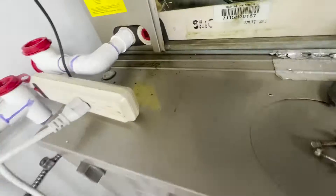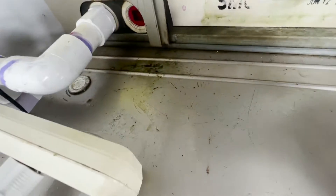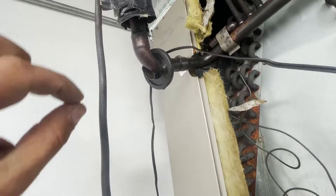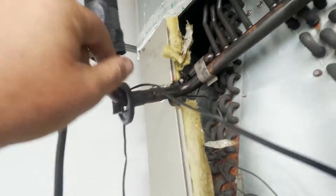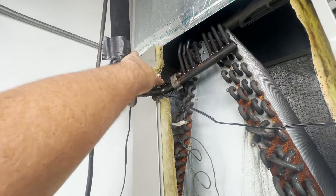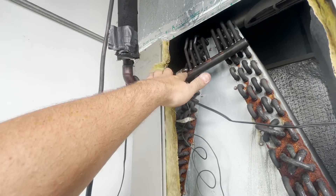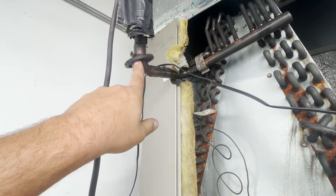F3, furnace 4. We got a call because this oil is accumulating down here, which is a very good visual catch. Definitely dripping off of this elbow. So we first just checked to see if that bad boy was leaking and it's pretty tight, so we're gonna get our bubble solution and start to check some of these joints and this one here.